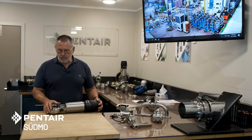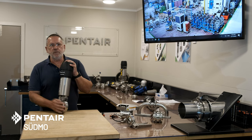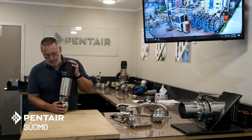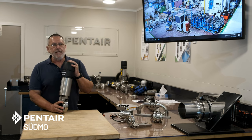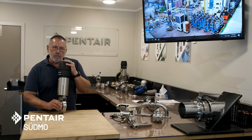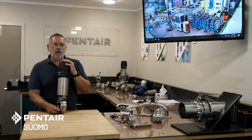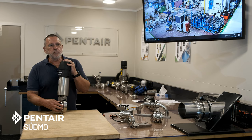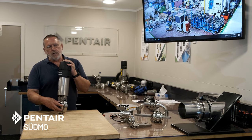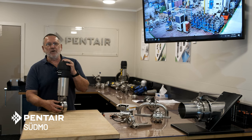A note about figure numbers: the figure numbers are inherited from our previous parent company, Keystone, an American firm. The F-250 butterfly isn't the only butterfly valve we make — we also make an F-251. The difference is the F-250 is designed for imperial standard tubing: one inch, one-and-a-half up to six inch. The F-251 series is designed for metric tubing: 25, 40, 80, 100, 125, and 150 millimeter. It's essential that you get that right when supplying a valve.